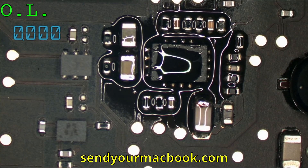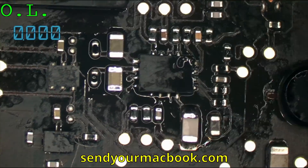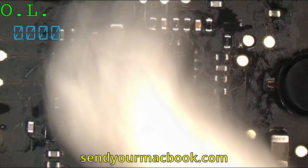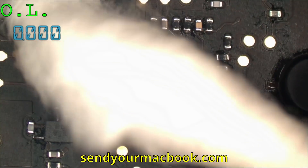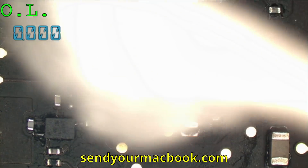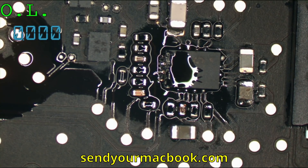Using a toothbrush with alcohol, then paper towel and alcohol — you're adding a bunch of steps. I'm sure that works if you have a giant mess, but this chip is tiny. All I do is twist the Q-tip over the top of it and it picks up all its stray strands. Once you get it clean enough, the stray strands just blow away anyway because there's nothing for them to stick to.